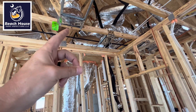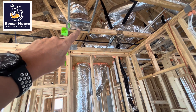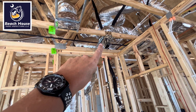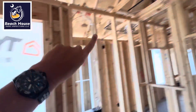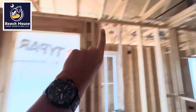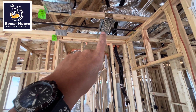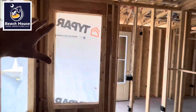When I measure this with a thermal camera at closing, I'll probably get maybe 55 to 58 degree air coming out of here. I'll measure the return — guess what temperature it's going to be? It's going to be about 60 degrees, because the air is going to come right through here and go into the return, never entering any part of the rest of this living area. If this was installed properly with the supply line near our heat loss, with a thermal camera this usually comes up around room temperature — around 70 to 75 degrees — because it's taking that warm air, pulling it across, and going into the return.